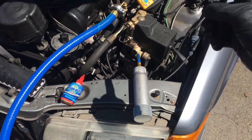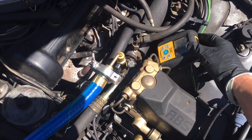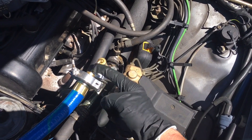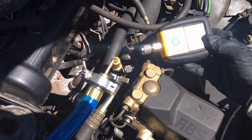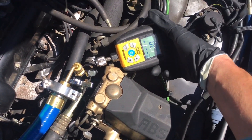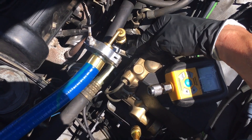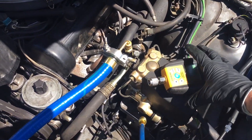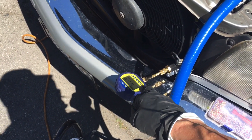The vacuum pump is in operation. The way you combat that — when you think you've got your vacuum down to 100 or 200 microns, it'll raise. You turn off your vacuum, you isolate it. Now the vacuum pump is no longer pulling, but you would have your micron gauge hooked up to your port on the other side of the shutoff. That's where you take the vacuum reading and watch it rise and level out. So if you read 500 microns while the vacuum pump was on, you might actually read 1,800 microns at the other side.